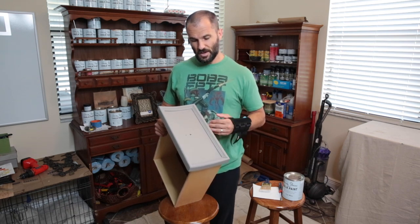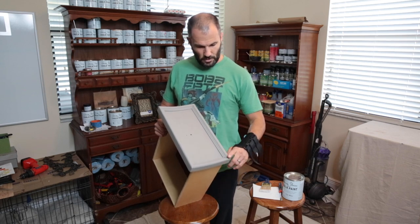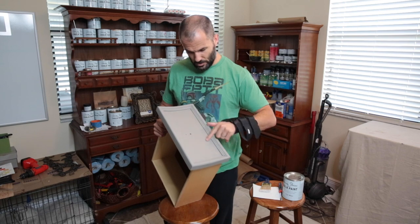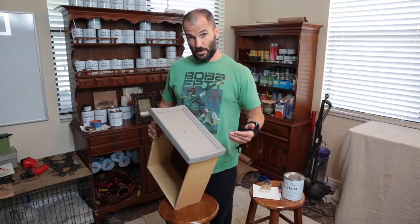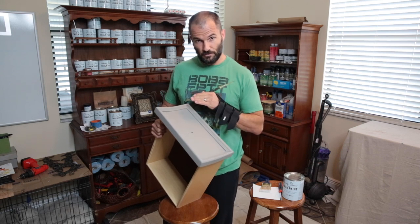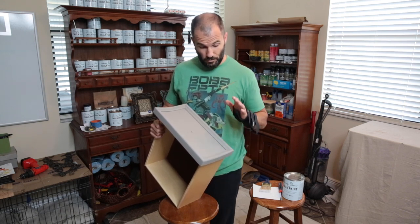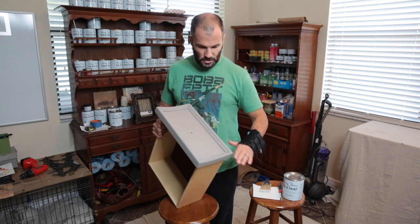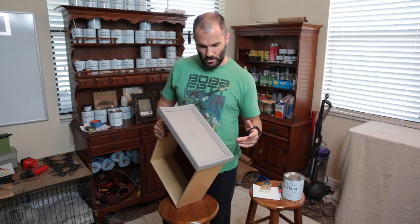For this effect — it's called French Castle, so like a stone look — I'm going to do a white dry brush over the top. I'll do the raised areas, all along the edges will get a little white, and then I'll do some across the flat areas where you'll see my brush strokes. Now you might think: why dry brush the raised areas if you're going to distress them? But some of that white will get distressed away and some won't. So you'll have a base coat, a dry brush, the distressed area, and dark wax — four different layers of texture.